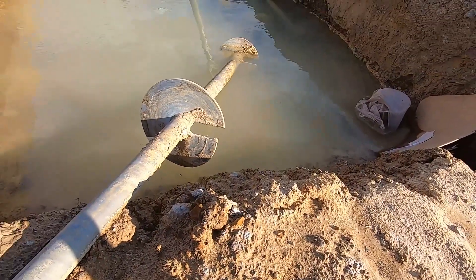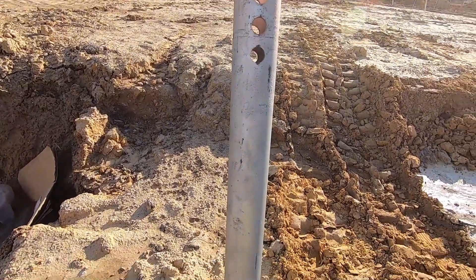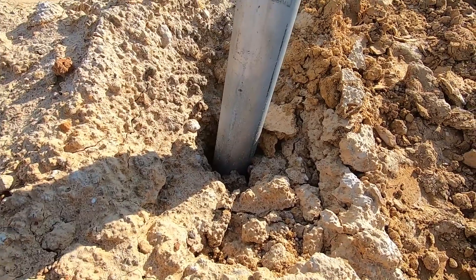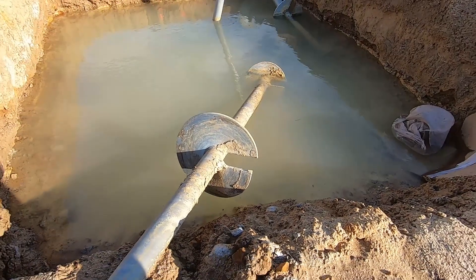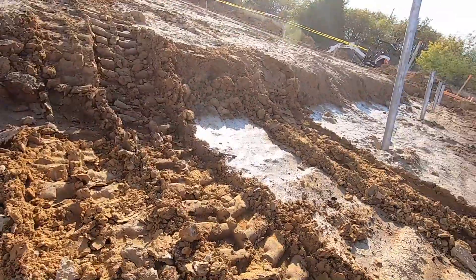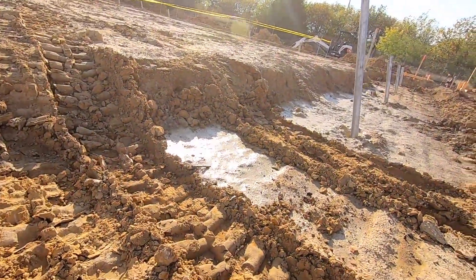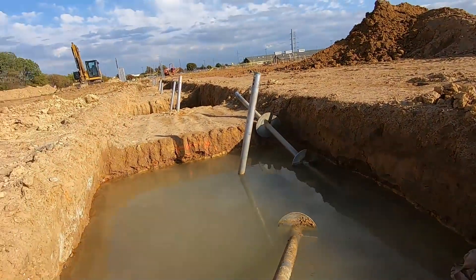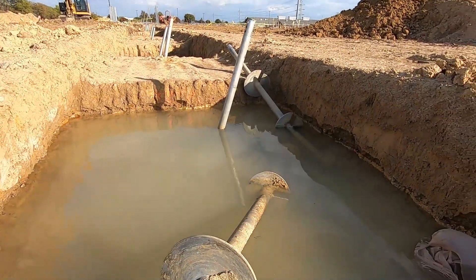It can't pull out because the dome actually wants to pull things up. That's what it looks like once it's in the ground — it's going deep, and they just keep extending it as far as they need to. Once they're in place, you can see they're at an angle just to provide the right level of resistance. They line up all the way down to create the grade beam for the dome foundation.